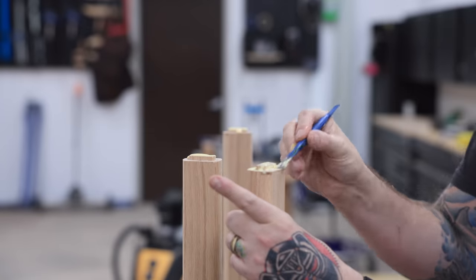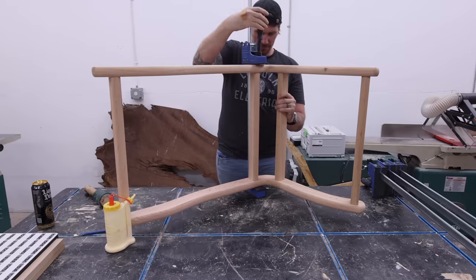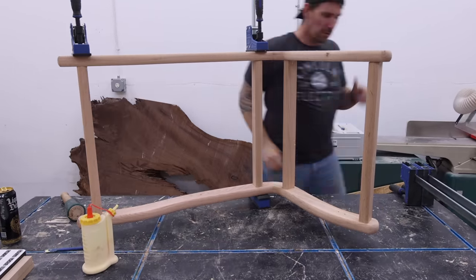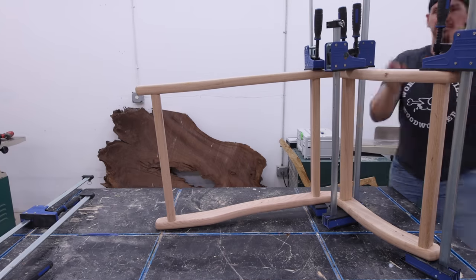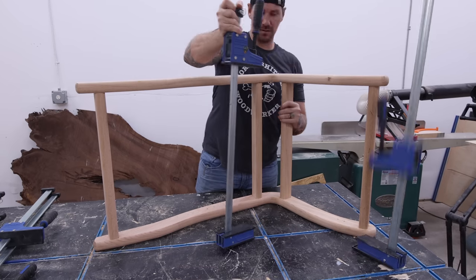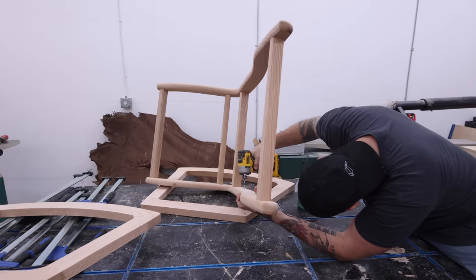I want to reiterate that the tenons I cut are mainly for alignment. If I was going to make this again, I would have cut the mortises on the seat parts three-quarters of an inch deep initially, but I kind of messed this up while cutting those on the CNC and only cut them a quarter inch deep. I really didn't think about how I was going to make the stretchers later on. These tenons are still really useful to align and glue up the seat assembly, but that quarter-inch mortise and tenon just isn't adding much in the way of strength — the glue joint itself should be strong enough. I'm going to add through-dowels later on to add a little bit of additional strength to each joint.